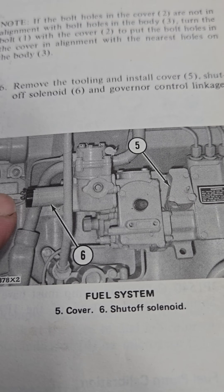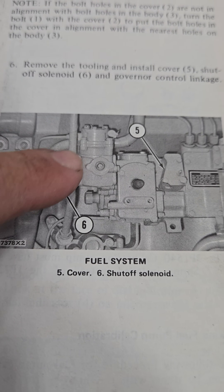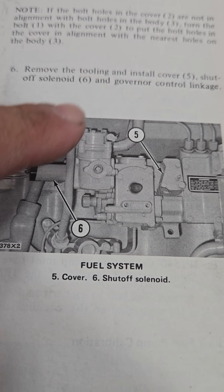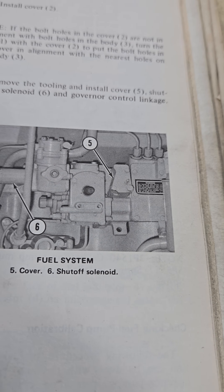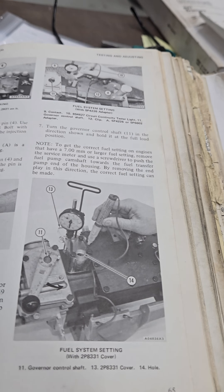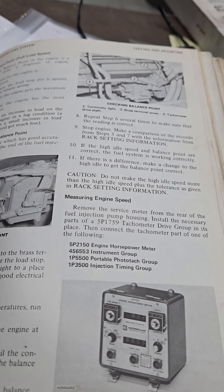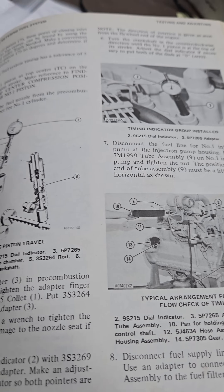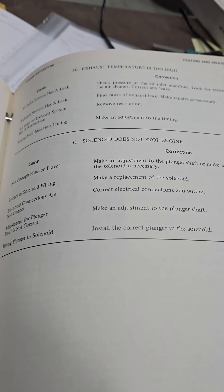A lot of those excavators in my rack setting book don't even show that there's an air-fuel ratio control on those 3304s — yours may not have one. But like I say, under this cover is where you're going to increase the rack setting for more power. My suggestion is to get a service manual — an original CAT service manual for this. It's going to help you incredibly to understand this system so you can work on it if you don't have anybody qualified to do that for you.